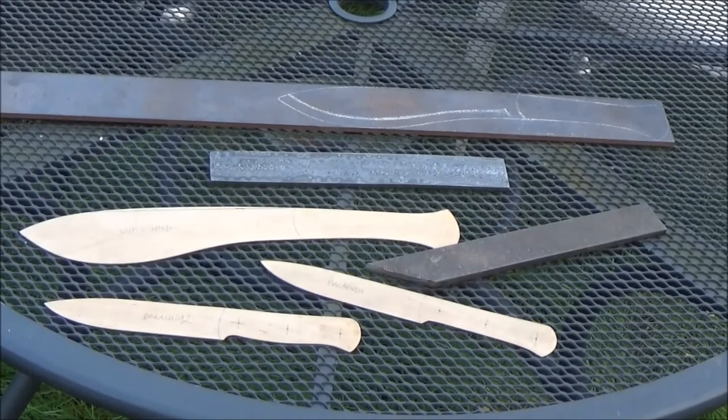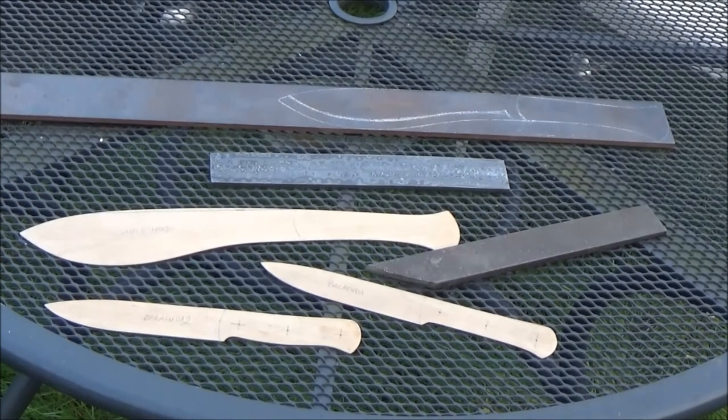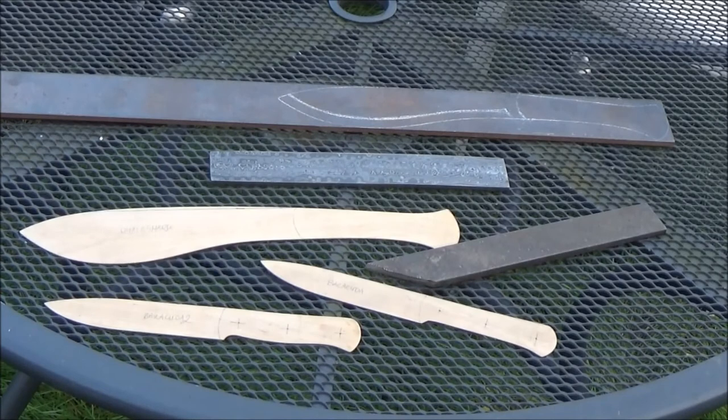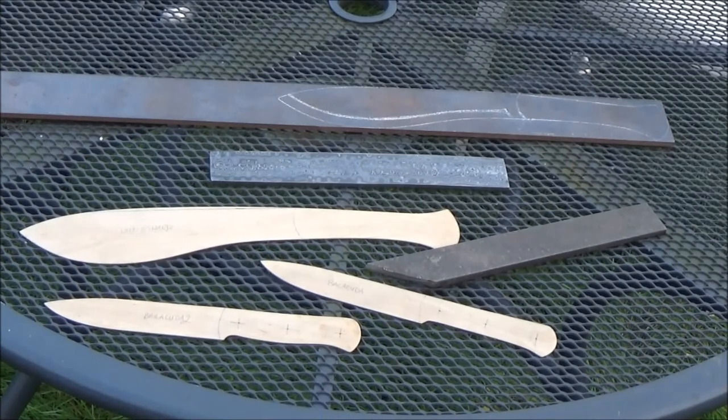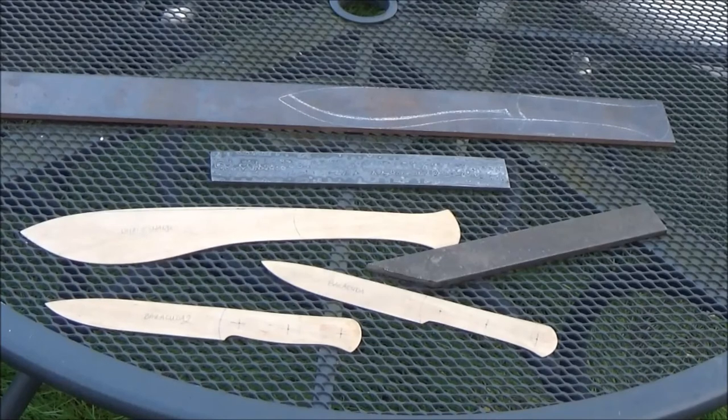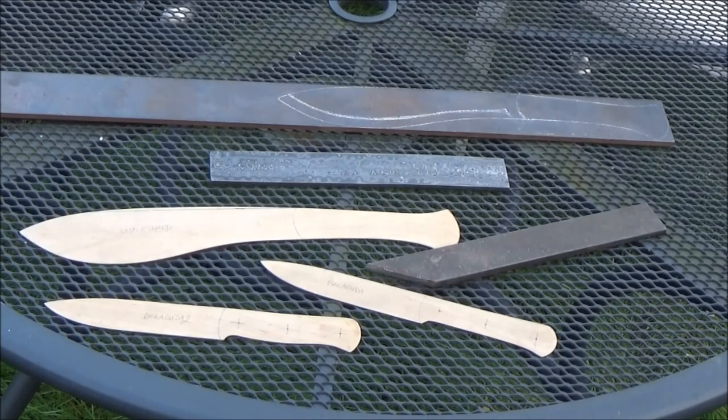But they're future projects. I think once we get a month or two's time, once the weather starts to warm up a bit, it'll be easier to set up the forge out here. All I do is pile up a load of bricks I've got here for the rocket stove, and pump air in from a compressor, and you can get the heat up to the required 800 and odd degrees so that the metal stops being magnetic, so you can plunge it into the oil. So there's no problem with building up the temperature.